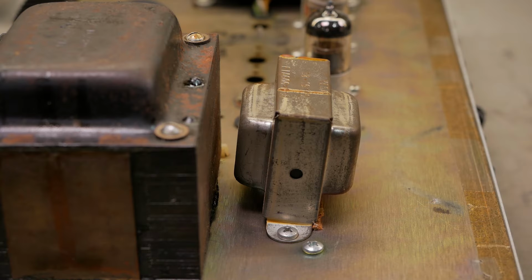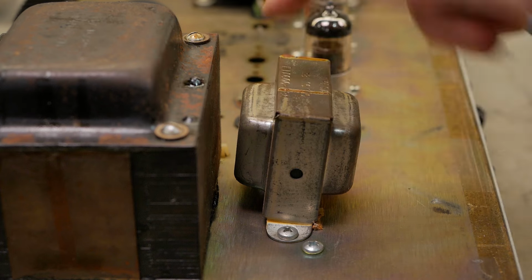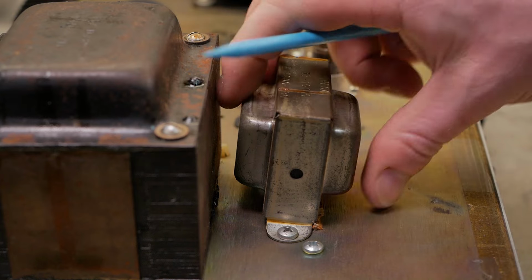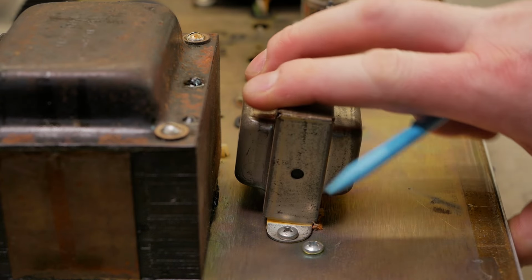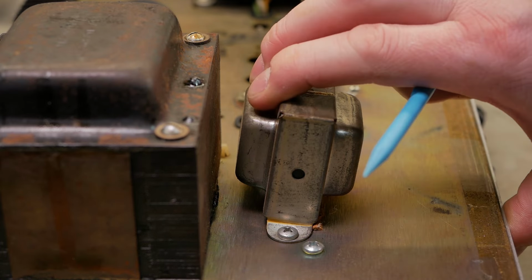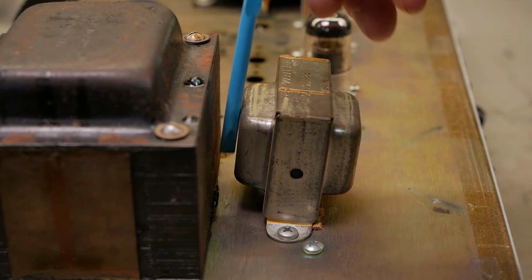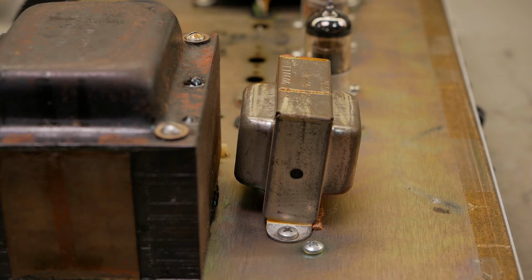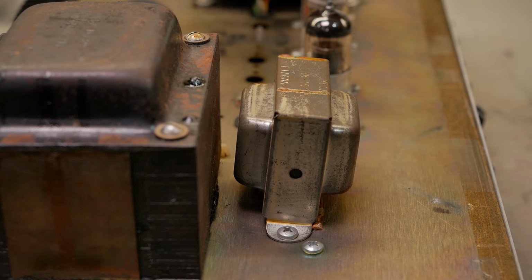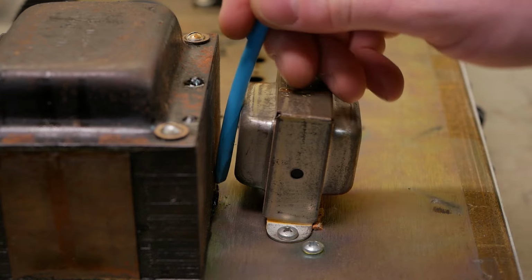So pretty sturdy. One funny thing you see on the earlier Mesa Boogies is the chokes kicked over on an angle. When they come from the factory, they jam a wedge of timber in there. And, you know, that sort of works for a bit, but with the vibration and rocking the thing around, eventually the frame just becomes fatigued and the bit of wood falls out, and it's just a chunk of wood floating around in your cabinet, so you wonder what that is, and it falls out in your car, and then you pick it up out of your boot and wonder what it came off. And in the meantime, they could have just used the same washers they used over here and solved the problem, you know, a bit more professionally instead of jamming a chunk of lumber in there.